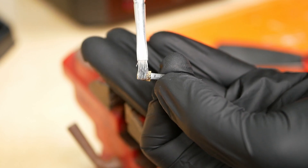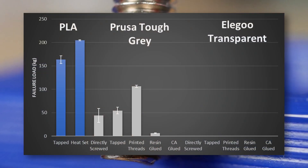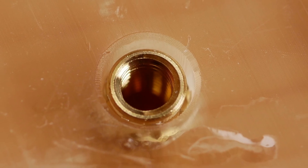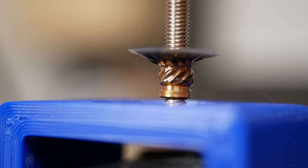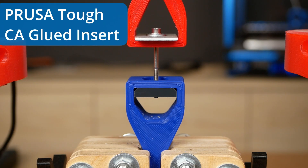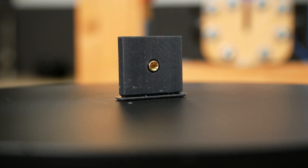Now let's get to the heat-set inserts glued into the part, starting with resin bonding. The first set of samples failed at only 6 kg — taking a closer look showed that the resin didn't cure, probably because the black color prevented UV from passing through. Due to the low viscosity of the resin, it also wasn't good at filling the empty voids around the insert. Compared to resin, the CA glue was thicker and able to bridge some of the gaps. Those samples bore 52 kg on average until failure and also exploded the part. The superglued inserts reached the same strength as directly screwing into the parts, while having the advantage of being way more durable for repeated assembly.